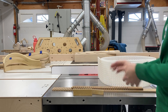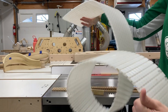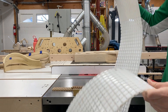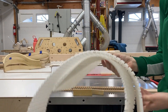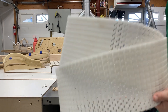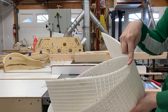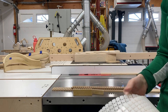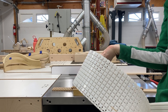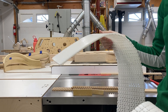You're not limited to making kerfs just out of wood. You can also make them out of different materials. Here's an example I made at one point in plastic because I was having trouble finding a piece of plastic that would create a really dramatically bent and twisted form I could use as a template to flush cut a giant piece of bent lamination. So I made this as a flush cut template — the bearing of the flush cut bit would ride on the thickness of this plastic — and because it has no short grain it was pretty sturdy and conformed to the compound curved surface really nicely. The only problem is that it was very time consuming to make.